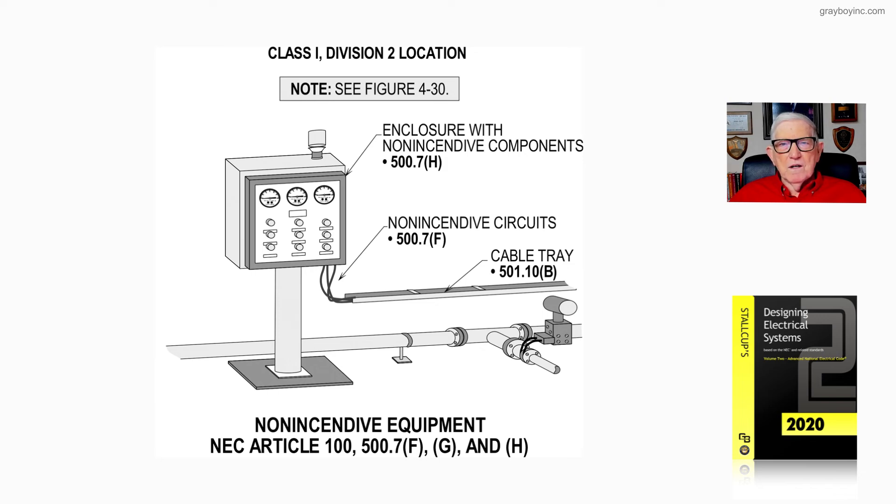We suggest starting with figure 4-30 and looking at all the figures pertaining to non-incendive equipment. A lot of areas where this equipment is used fall under 501.105 — for instruments, meters, and relays. You can also go to 501.150, where non-incendive is addressed under certain conditions such as hermetically sealed contacts and oil-immersion type contacts, and can be used for signaling, alarm, and control. Two sections people use this type of system in quite a bit are 501.105 and 501.150.